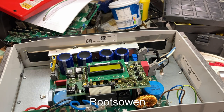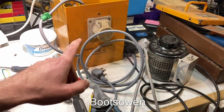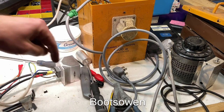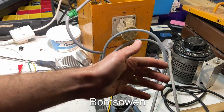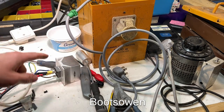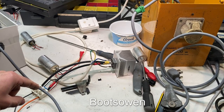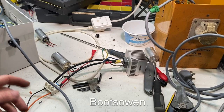Let's see if it fires up. How this works: we've got power coming in through the variac, getting stepped up through an isolation transformer. Because it's an isolation transformer it breaks the link between the power — if we didn't have that it would be difficult to have the solar inverter running on the same power supply as the DC side. So this is going to create the DC power: isolation transformer going to a rectifier which also has a smoothing capacitor and a bleed resistor — the little blue resistor there — coming out in this orange and black wire which will be my DC input.